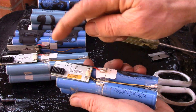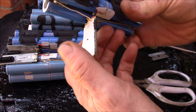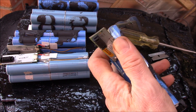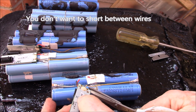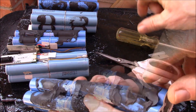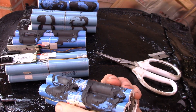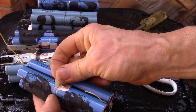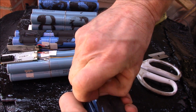Now I cut off all the circuit boards - these are the battery management boards. They have four wires: black and red for power, and white and yellow for voltage sense leads on each end. Cut one wire at a time, then clean off any blobs that would interfere with the cell holders. Get all the tape off the ends.